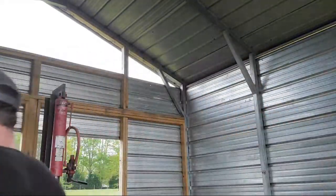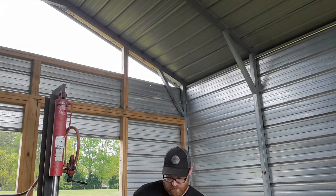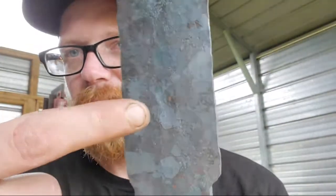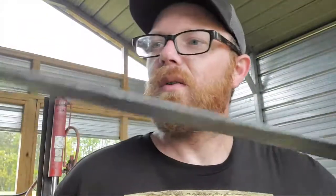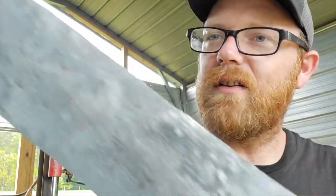All right, guys, let me hold this up one more time so you can see where we're at with it. That's the hammer mark right there that I think is going to be a difficult one to get out. A misplaced rounding hammer mark. You see the rest of the bevels are pretty well planished. You can see the ridge right there, to the point where the ridge starts right here, and that ridge goes all the way down the center. And I got that one goofy.